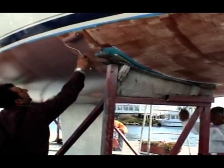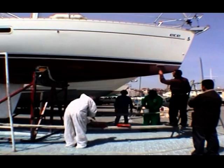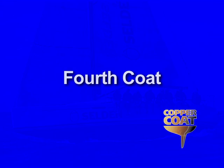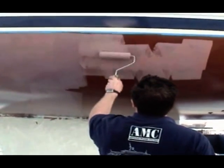As with most painting, for a seamless finish always try to keep a wetted edge. As the coating's thickness builds, the gel coat becomes barely visible and the patchy appearance lessens. Occasionally the treatment can look complete after just three coats, when in fact a fourth is required. Usually the treatment is completed with a fourth coat — by this stage the coating appears thick, glossy, and deeply copper rich. While four coats are normally sufficient, it's imperative that all the supplied product is used. If any goods are left over after four coats, this indicates each coat was applied slightly thinner than usual; simply continue to apply additional coats to ensure the correct overall thickness.